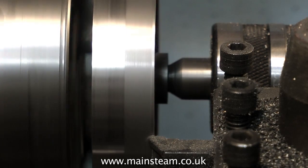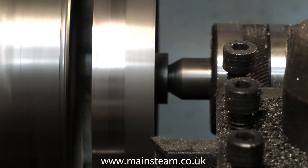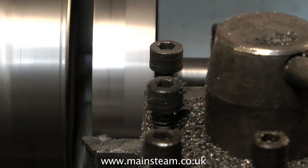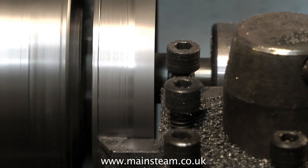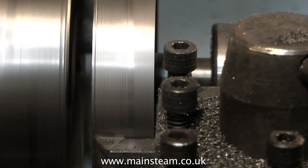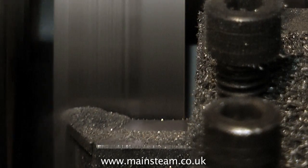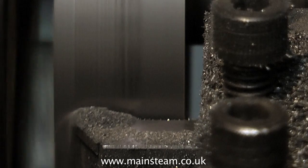Looking on the bright side, at least I can't see any blowholes. What I can see though, owing to the fact that the tool's been given a real hammering going through the hard outer shell, is that the flywheel's out of true again, even though it's held tightly in the chuck with the live centre pushed against it. What I'm doing now is setting the traverser to the opposite direction, so the cutting tool will cut away from the chuck. This is often a good idea because of the shape of the tool — it means that you will get more of a gradual cut. So if we watch for a moment and see whether we get a grey colour or a shiny colour — a grey colour! So the cutting tool is getting underneath the part of the casting that's chilled, and hopefully if it carries on like this we should get a good cut.